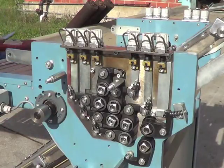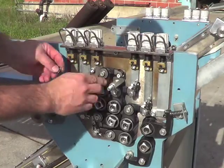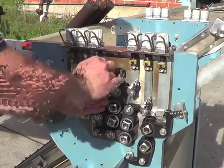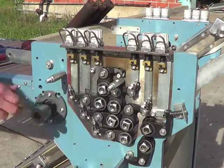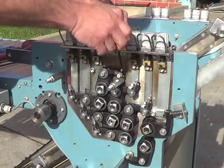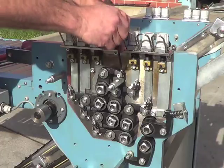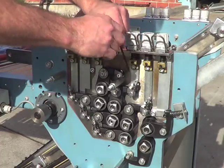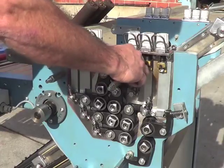The spring should be giving you back tension so that when you assemble the spring clip and put it on, there should be tension on that spring. Assemble the last for the stationary roller with the screw to lock that in place. That should finalize the six rollers core exchange.